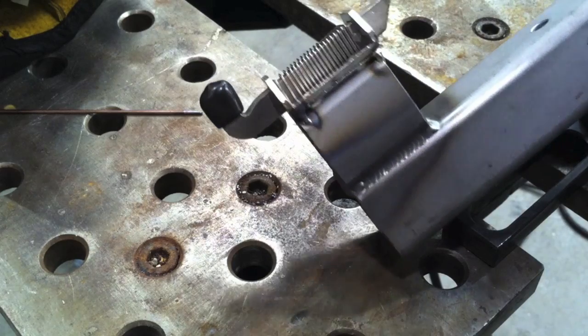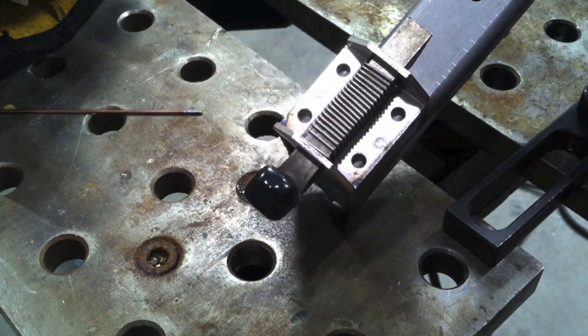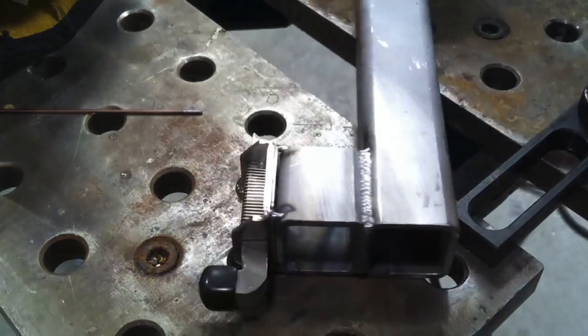This thing is normally designed to be fastened down with bolts or screws - you can see the holes in there - and it's only held together with a couple of spot welds. It's got a really thin spacer plate, so I need to tie all three of those things together. If I just weld the carbon steel to that spacer plate it's not going to be very strong, so I'm just going to fuse the two members together. It probably would be better to use screws, but the print called for welding and it's just not worth the back-and-forth trying to get resolution on it.